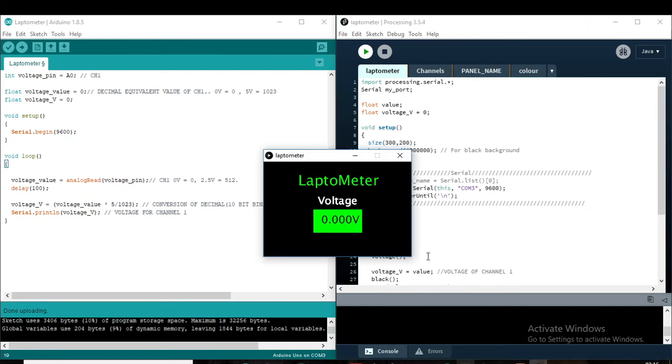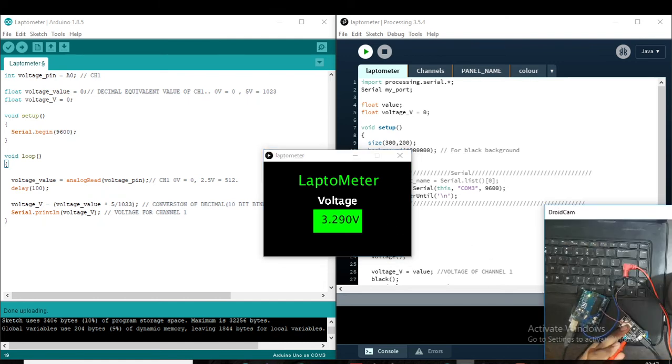I will run the program and check the voltage. On the NodeMCU, I am trying to measure the voltage. I put the positive probe on the 3.3 volt pin and the negative probe to ground — and it reads 3.2 volt.